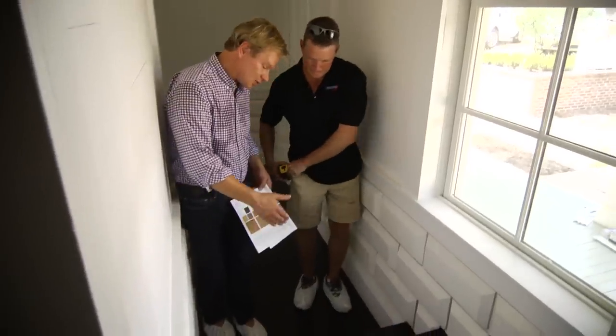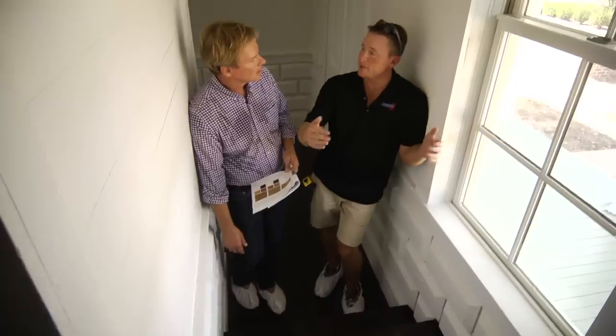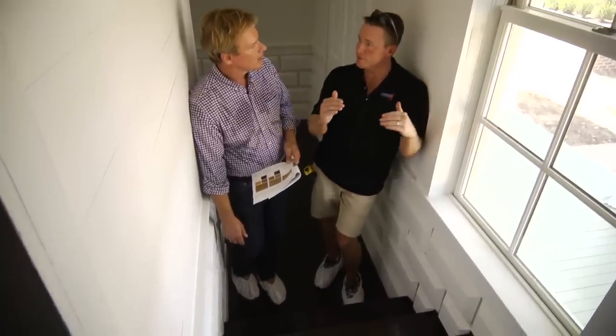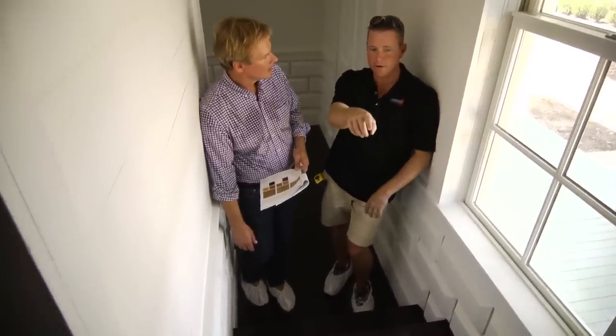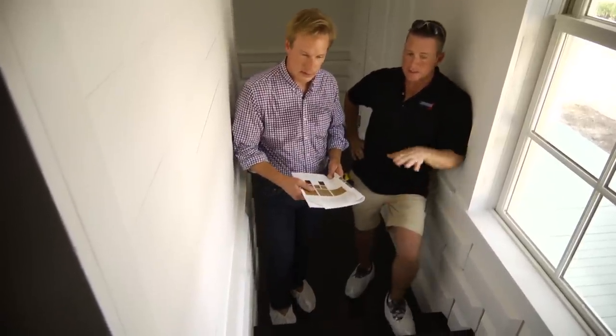So how do you measure, because you're not only measuring the top of the tread but you're doing the rise as well? You'll come over and down, and typically you're going to count two feet for each step. Out of a 13-foot carpet, you're going to get four steps for every two feet. We've got two four-by-four risers, which will come out of another four-foot piece, so we'll have very little waste.